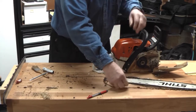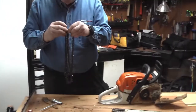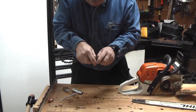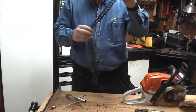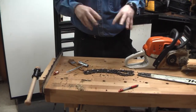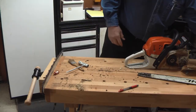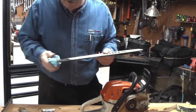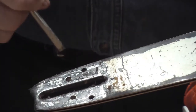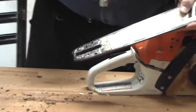If you're going to put the chain aside to be sharpened, Marvel Mystery Oil is a good thing — it gets the organics off of the links and cleans the grit out of the links themselves. Just take a half-gallon plastic jar with maybe two inches of Marvel Mystery Oil on the bottom, drop the chain in, and let it sit for 24 hours. When it comes out it's all bright and shiny. The oil comes out of the oiler port and passes onto the chain through two holes.